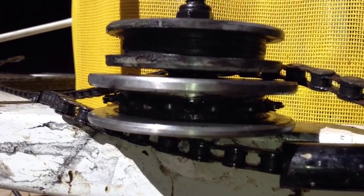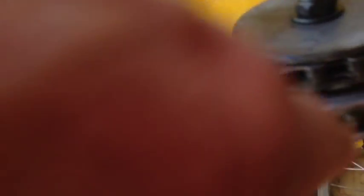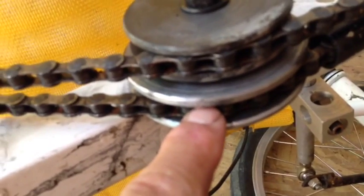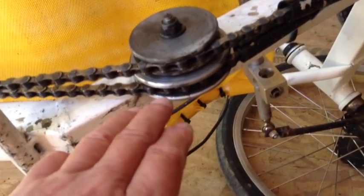So there's two ways you can go with this. This one has a sprocket in it. The reason why there's a sprocket is this chain is a series of flat spots. And if you don't have a sprocket in there, if you just have a groove, when the chain flat spots go over the groove, you'll get a vibration — you'll hear every link on the chain go over it.